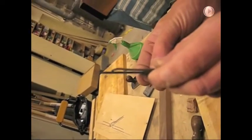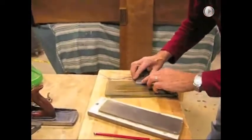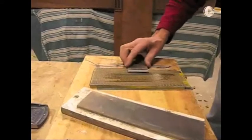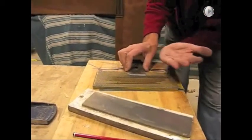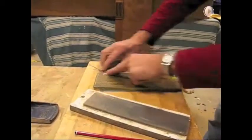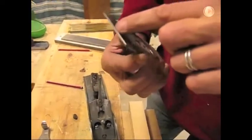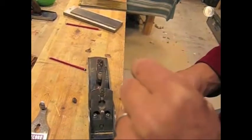Can you see how it's not actually sitting flat down onto the blade? It's sort of angled upwards. So I'm going to work on creating a better flat to sit down onto the back of the blade, working it back and forwards. The iron is angled slightly downwards — off the horizontal. I'm using my fingers running on the surface of the workbench to hold it steady. I've got a nice flat all the way along there, but it's still going away a bit and still slightly rounded — I need to sweep that down a bit more.